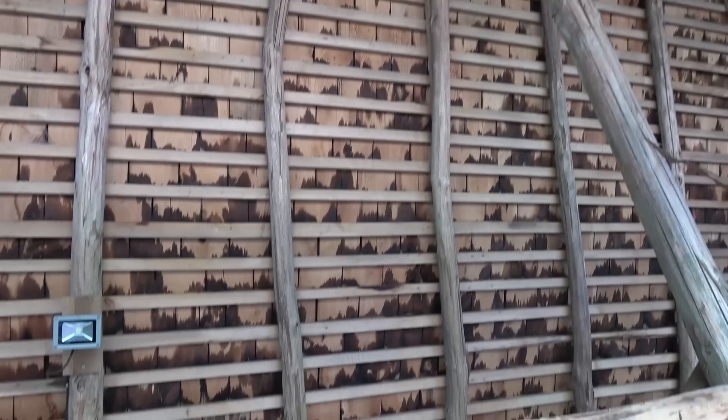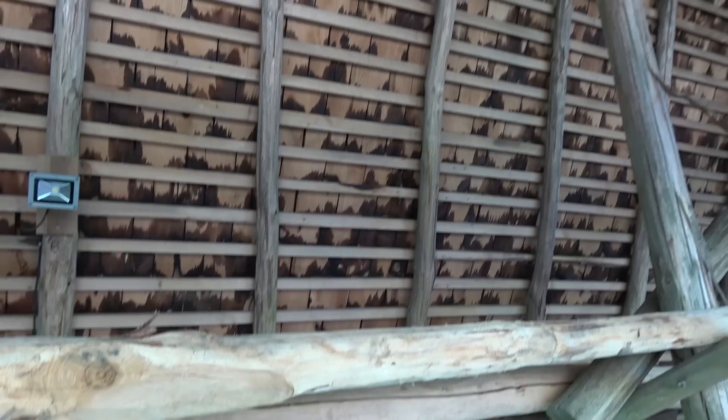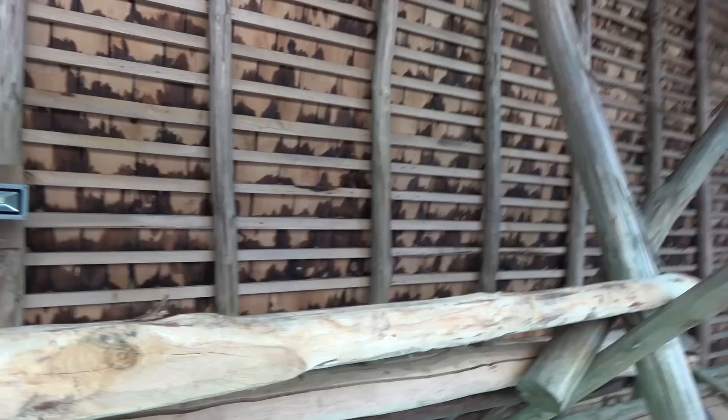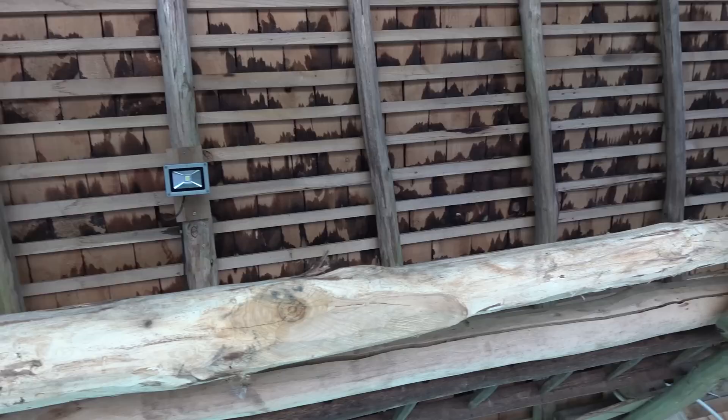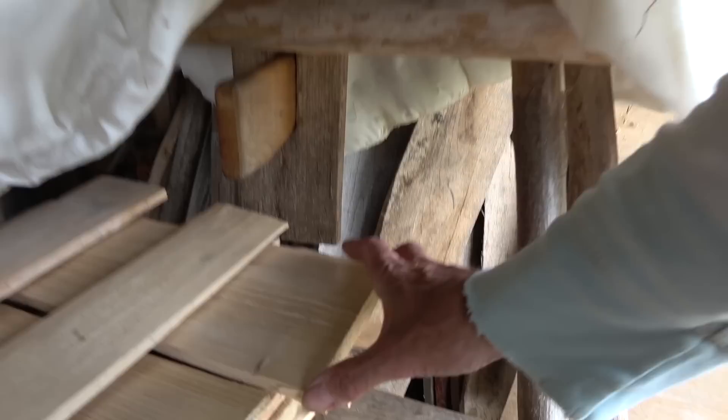Now if we look to this side — oh, what a difference! It looks like it's damp, but it's not damp. That's just a little bit of moisture getting in and drying out, pulling the tannins through and leaving them in the timber. The whole of this side — that's our fault, that's the sawn side. A very small amount of damp is getting into the shingle and as it dries out it's pulling those tannins through. They look as if they're soaking wet but they're actually bone dry. What it does indicate is that the life of the handmade cleft shingle is going to be a lot longer — and in fact this side was put up about six months before that side.